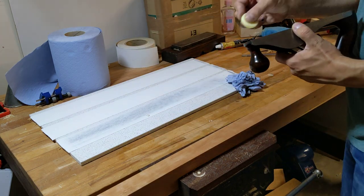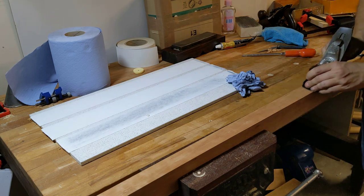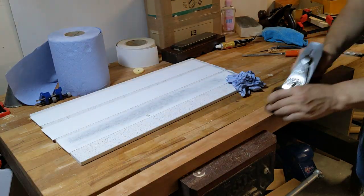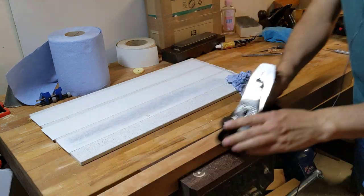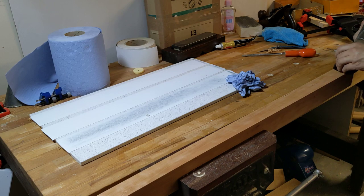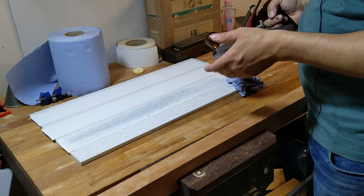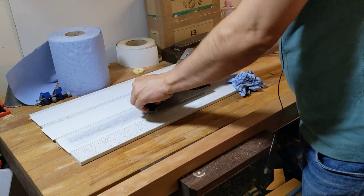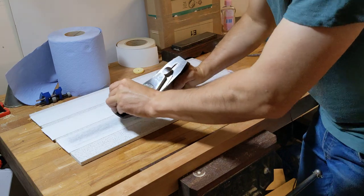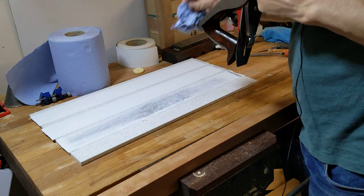Let's take our tea light, leave the sole a little bit. Beautiful. So again, just an eBay plane. Doing the business. One thing I'd also recommend doing, again, we've got a bit of time to talk about it, is with the plane, if you've got this bit of abrasive set up, holding it up on its edge, just relieving all the edges, perhaps doing a bit of a basic round over everywhere, just to take off any little humps and bumps that might be lurking.